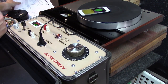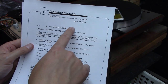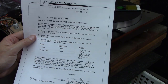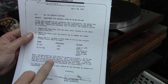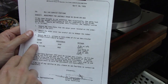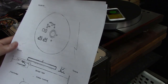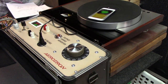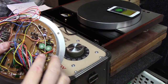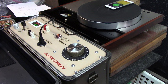There are some instructions available online — this is a service update from April 26, 1978 for the 441 or 444. It tells you there's VR1 and VR2 in here: VR1 adjusts 33 and a third, and VR2 adjusts 45. It includes a picture showing where VR1 and VR2 are located, and you can see them here on the board. They look slightly different on the one we replaced — they're the little flat wafer type.